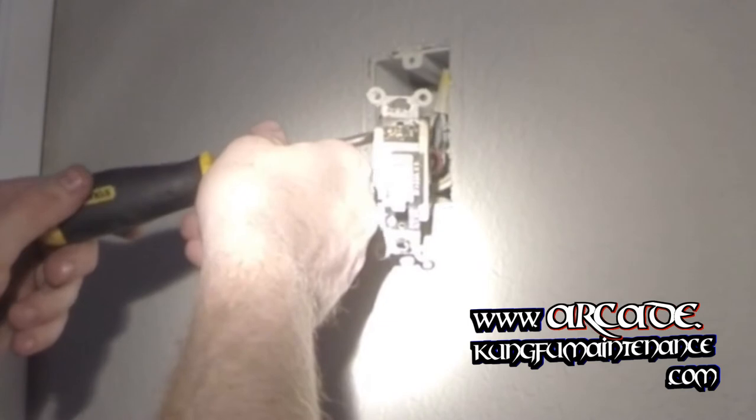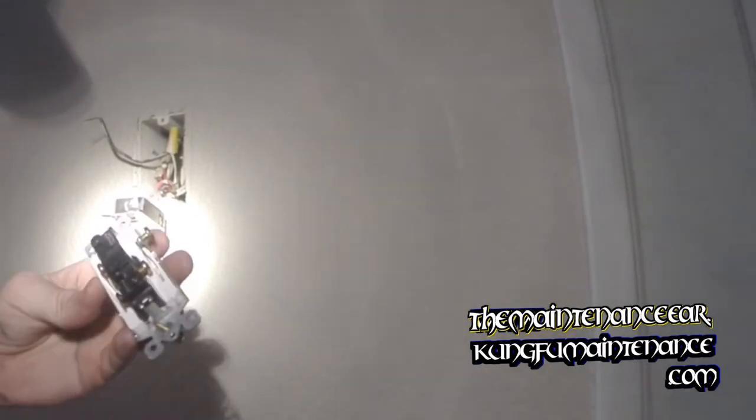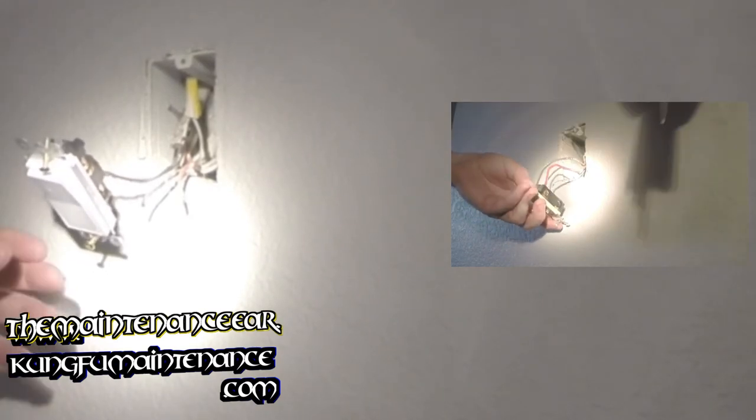It's a good idea to use a chirping alert device to prove whether your power is actually out. This switch is quick-connected. You can use quick-connect or side wires. With the quick-connect, you need a flat blade screwdriver — you can use the release buttons to pull the wire out. Our common wire is going to go to the middle port. The quick-connect just pushes in. Our other two travelers — it doesn't matter which position they're in, as long as they're connected.